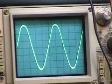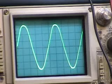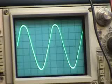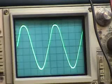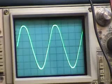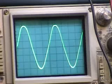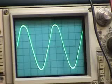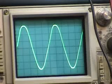It might be better with some fresher tubes, but that's reasonable. These are a fairly balanced pair of tubes that I've got in here. And I'm going to experiment and see if replacing the preamp tube helps any, but I don't expect that it will. This is probably limited by the output tubes. But there we go. We're getting a nice reading there of 11.3 volts on the voltmeter.